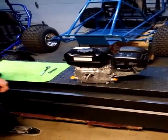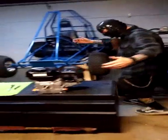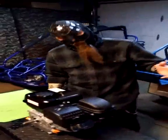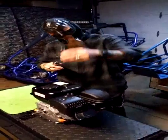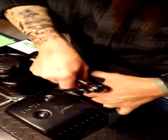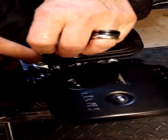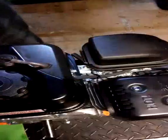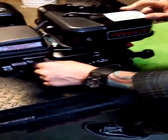Once the cap is on tight, we can make our preliminary checks. Walk around the engine and make sure everything's clear — it's clear. So there's only one thing left to do before we start: loosen up the throttle. It comes pretty tightened from the factory, so we need to take our 10mm socket on an extension and go right down into the middle, onto the top of the linkage where it pivots, and loosen that up. Just give it a couple little turns until the throttle arm is loose, then we can make sure that our throttle is free and moves back and forth without any binding.